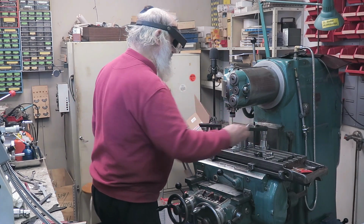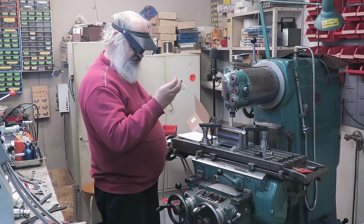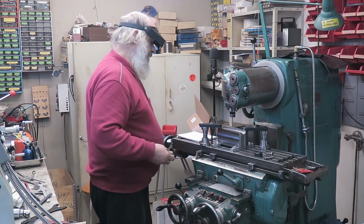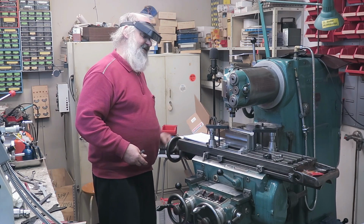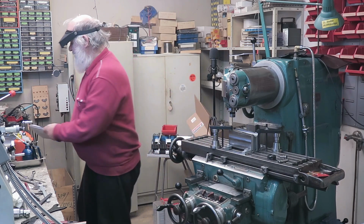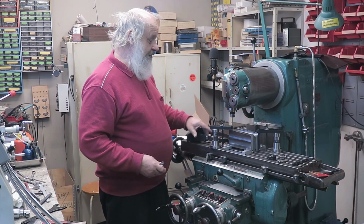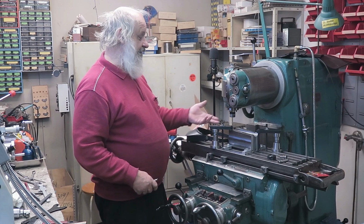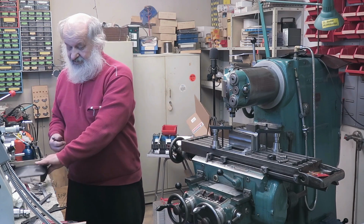And then what I'm going to use to mill this one is this, this is a Niagara 1/2 inch end mill, full carbide. So hopefully we have clearance. Yes, we have. Of course I checked that one. This is horrific. It has happened to me multiple times. When I do this kind of thing, I dial everything in place and measure, and then I put the final end mill here and find out that, oh shit, I cannot do this because there is not enough clearance.